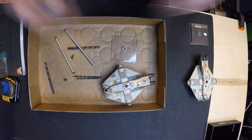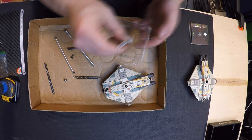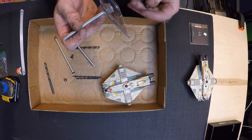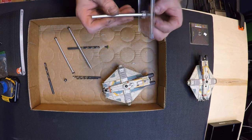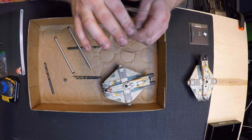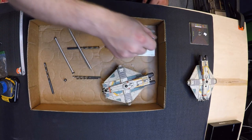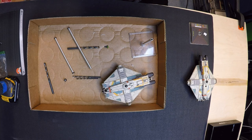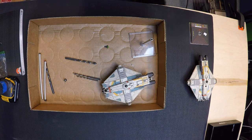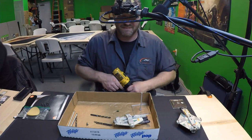So you have your rods and you do both ends, and the rod is going to go almost all the way through — but not quite. The quarter inch is a real tight fit. Then take your screw and screw it in with the countersink to make it flush. That covers the base and all three rod sizes. Next is the Ghost itself. You're going to take a $50 ship and drill a hole right through it.